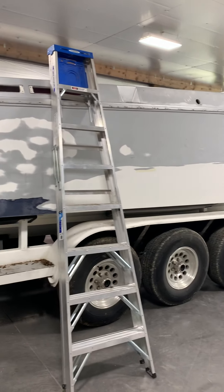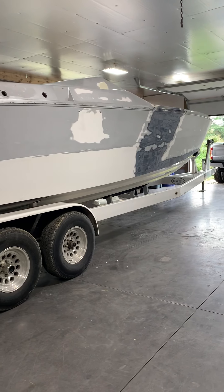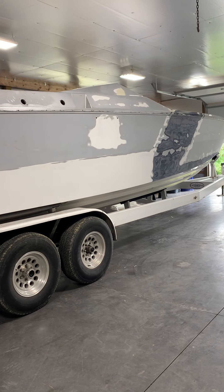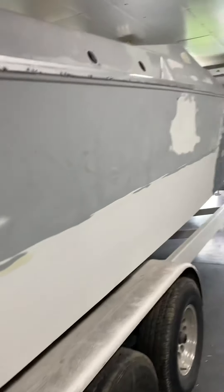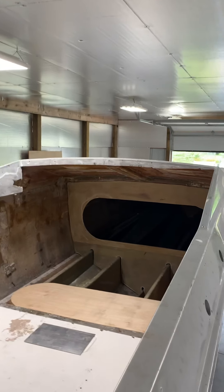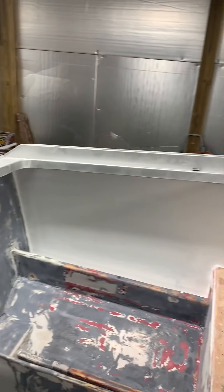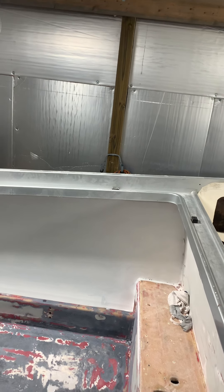Some say they can't believe we took it apart as far as we did. Well, we kind of had to — we found a rotten transom, and unfortunately up front we found rotted stringers. The boat probably would have stayed together for another 30 years the way it was, it wasn't that bad. But those of you with 1990 Top Guns know the liners move a lot — they crack, they flex. So we did the liner, the two-inch stringers, new fuel tanks, a fuel tank stringer, and a new transom.